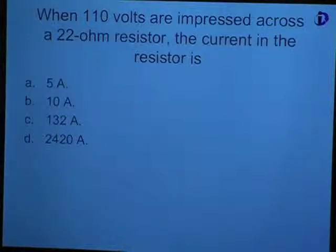And if you don't memorize the formula, I hope that me telling you, voltage is what pushes the charge. You increase the voltage, you push more charge. Resistance is what hinders the charge. So if you got more resistance, that's going to decrease your current. So it's directly proportional to voltage. It's inversely proportional to resistance. And that's where they got Ohm's law.